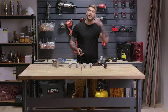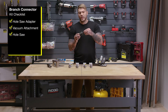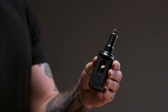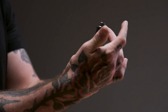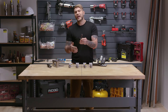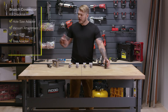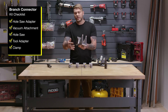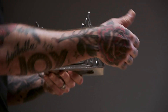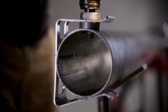Once you've drilled that hole, you're going to install the fitting using the tool adapter. The tool adapter has two parts: the tool adapter itself and the mandrel. The mandrel is what pulls that birdcage tight against the inside of the pipe. The tool adapter goes into your standard or long throw type tool, and you're also going to need the clamp. The clamp clamps the tool adapter down to the pipe so you don't get any skew when you're actually making the press fitting.